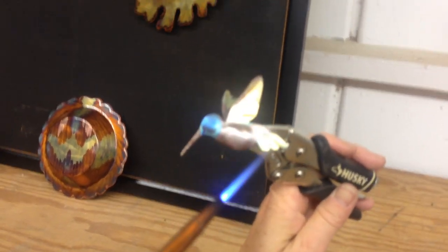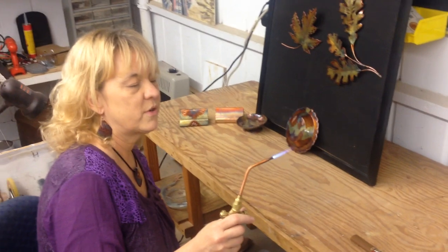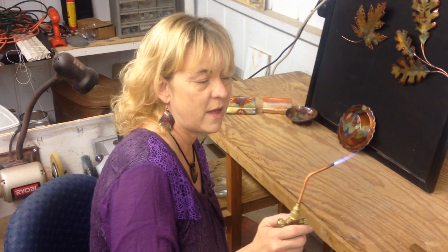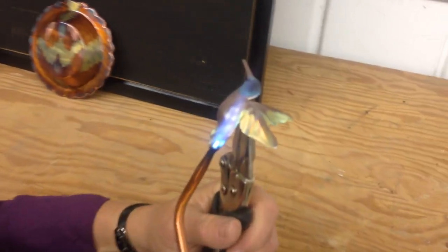You can see the colors coming in now — these are the hot colors. I'm going to cool it in front of the fan again. The temperature has to go from the hottest color first, and then I'll come in with my next layer using the reduction flame again. I'll create another pattern and then that one will become my mid-heat colors. Let's allow this reduction flame to have some more of that oxygen.